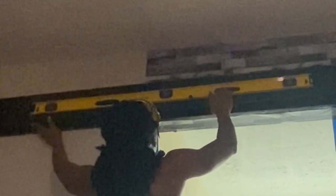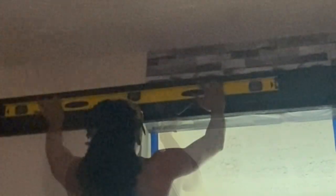Here's a view of me using the flexibility of starting with the middle spacer to make sure things are leveled off. Then I begin tightening them down, making sure they are getting leveled, then tightening them down again, repeating that process until the railing is completely secure to the backing.